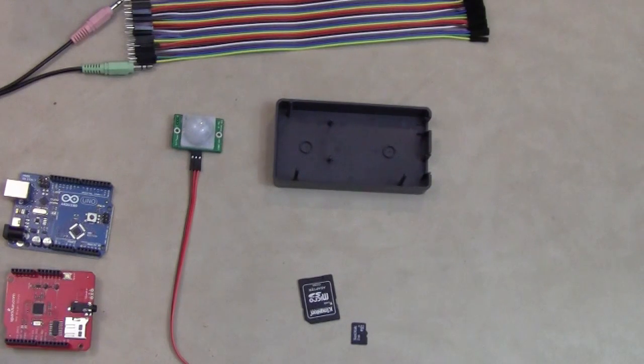I have a different kind of project for you today. It is an Arduino-based, motion-activated noisemaker that I call the Cemetery Howler. It uses an Arduino card, the Arduino software environment to program the card, and an Arduino MP3 shield, along with a micro SD card and a Parallax Passive Infrared sensor. I'm going to walk through the components, and I'll try to provide for you the source code that I wrote for this application. I think it's kind of unique.